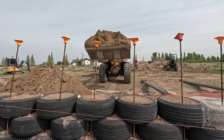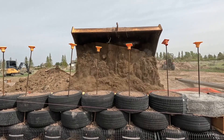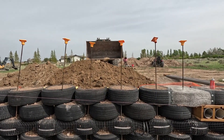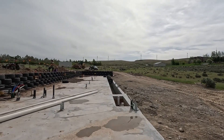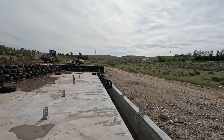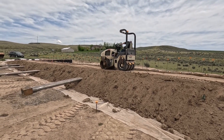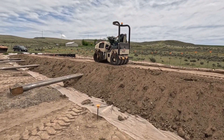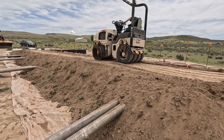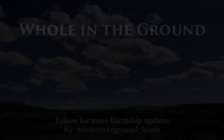After finishing course five of the tires, it was time for another backfill day. We've decided to backfill after every two courses of tires, which is why we needed that platform shown earlier. Our dirt contractor's equipment moves a bit more earth than our tiny tractor. As he was backfilling, Patrick and I were using shovels to make sure we got dirt in between the tires. I was a little worried about how the cooling pipes would hold up with the compaction, but they did just fine - they were not smooshed. Now we need to start building more of a slope into the earth bank, and we also have to figure out when to start wrapping the vapor barrier back up to form the envelope behind the home.